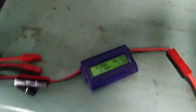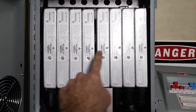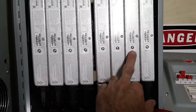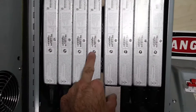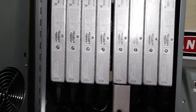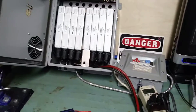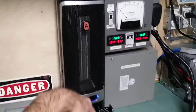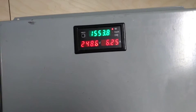The DC power is now connected to the microinverters. You can see all the green LEDs flashing five times, indicating they are okay, then flashing orange indicating no internet connection — but they are operating. You can see 36 milliamps of drain from the microinverters and zero amps from the UPS. All the power for the three loads is now coming directly from these microinverters — it's working: 1553 watts of power output.